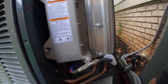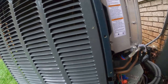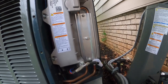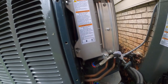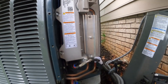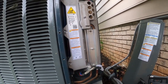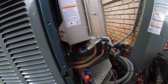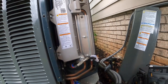When you bring it up to check charge mode, it tells you the outdoor temperature must be between 55 and 120 degrees if you're going to do it in cooling. This one is not a heat pump, so it's just a straight AC with a communicating two-stage furnace. The system is zoned — I do have both zones calling, or they should be calling in check charge mode anyway. Trane zoning, which is okay I guess — we haven't had a lot of problems with Trane zoning systems, maybe a sensor or two and a static pressure transducer.